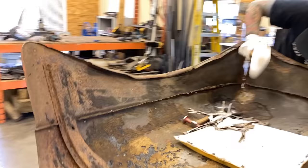Okay, there's a big dent right there. I'm gonna pull out the main chunk of the dent right now. When it's a big fat dent like that, where this line starts to curve, that's where I'm gonna put my dolly because this is where the bend happened. So I put my dolly on here and I'm gonna hammer there. And so that'll allow this to have ample room to come back out, and it'll also facilitate this bend from coming out as well.